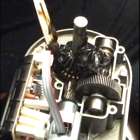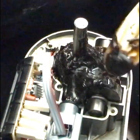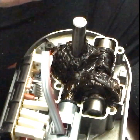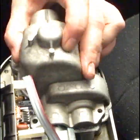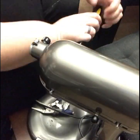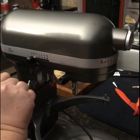Then you want to repack it really well. As you can see I'm moving the gears around — you want to kind of help it along. So repack it, put the little gear cover back on, and screw everything back together the same way you found it. Be mindful because there is a gasket under that gear cover. Screw it all back together and then I'm going to go ahead and turn it on.